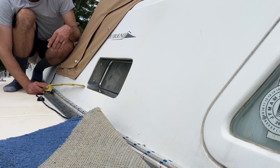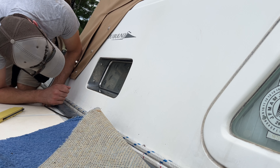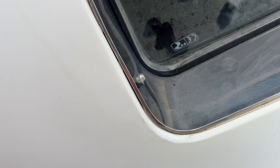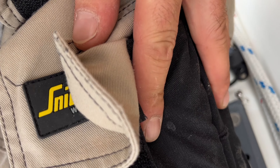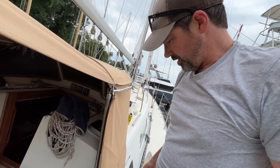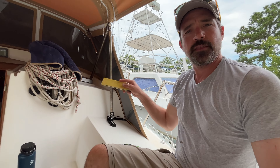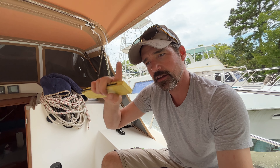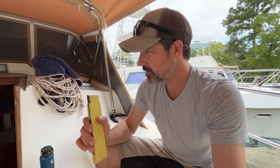It could be traveling up, but could this be leaking and traveling up to here? Very well could be. The question is — this is not sealed, and it needs to be. Check it out — we've got gaps, so this is leaking. And back over there, those screws are leaking. In reality, these screws should be pulled out and reset or epoxied in. The port light should be pulled out and re-bedded, although we might just caulk the outside of it as a temporary fix. In reality it should be pulled. That is my evaluation so far — the wood downstairs is a serious challenge.